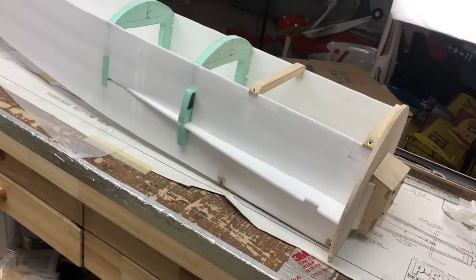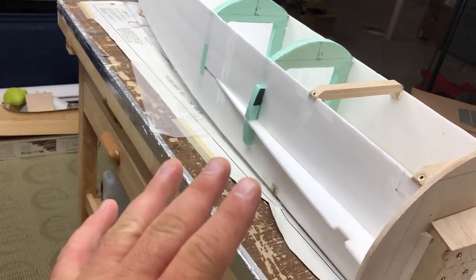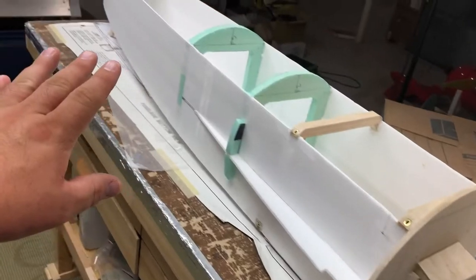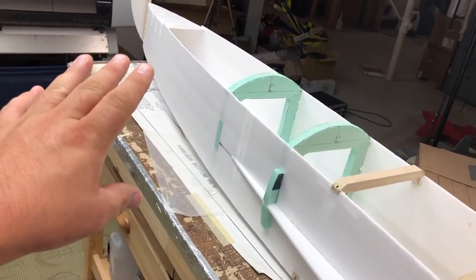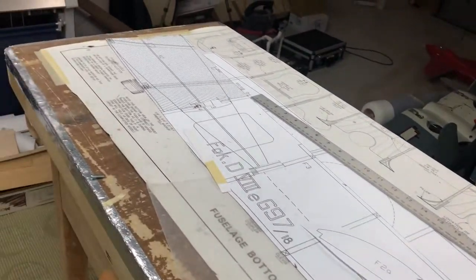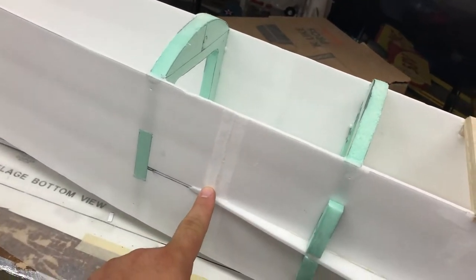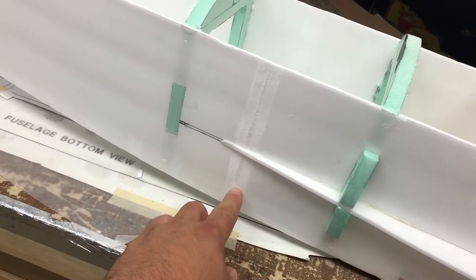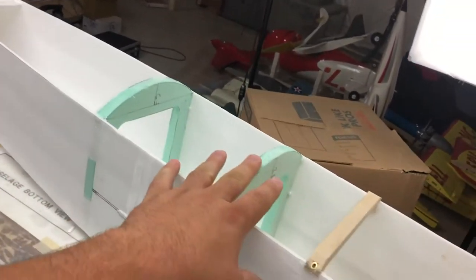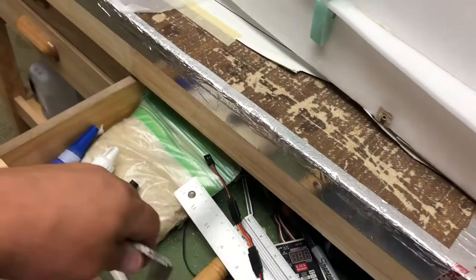There's good reason for that - we have to start working on the inside. We've pretty much used the same building techniques as on the wings: taking the formers from the plans, cutting out these flat panels. You can see there's a seam right here where I did a butt joint of two pieces of foam board to get the long piece. I used these two formers, made sure they were pinned flat to the board, and used my square to make sure everything was at right angles.